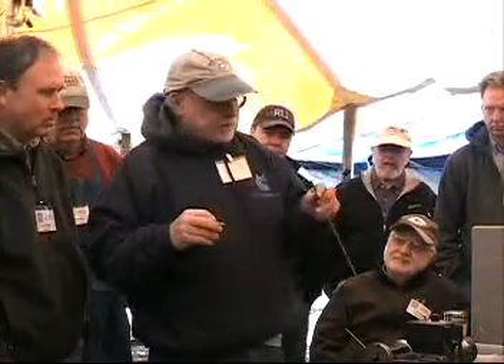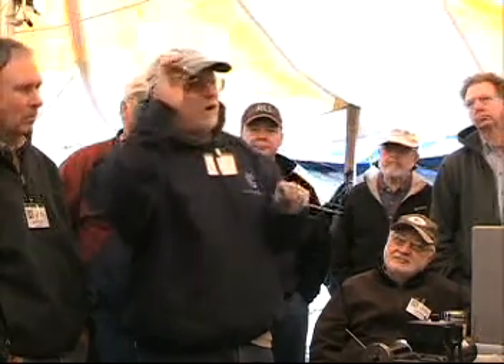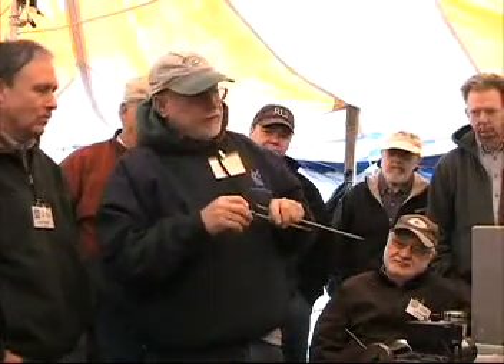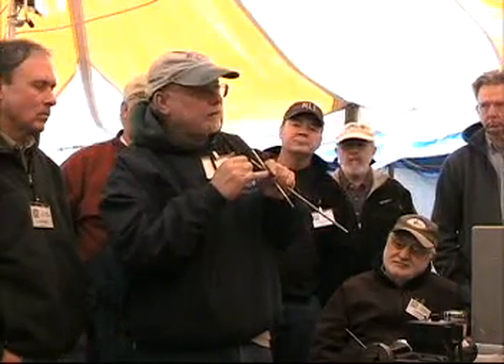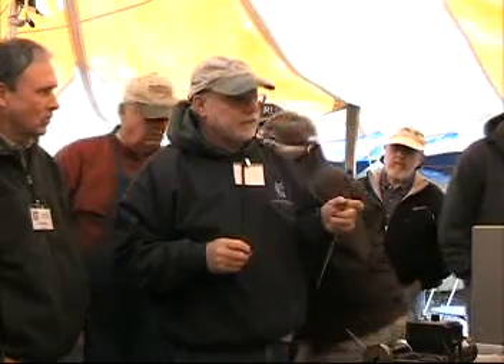What's happening here is the ID of this tubing — working off of memory — is .227. The OD of this is .233. So there's 6 thousandths difference in thickness here. What we're going to do is solder this in here, and then machine the 6 thousandths off to make it fit. Leave it a little fat — actually I'll leave it 2 thousandths bigger so that I can take that off of the slide.